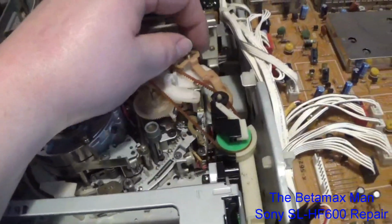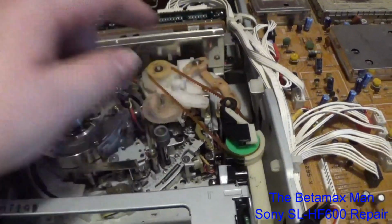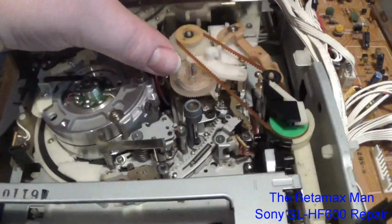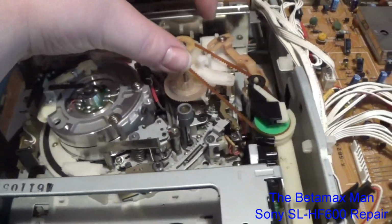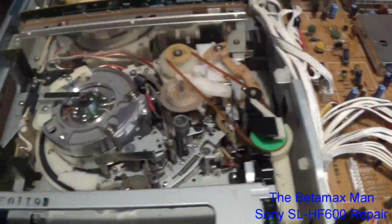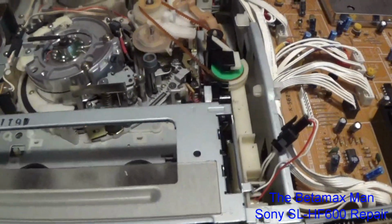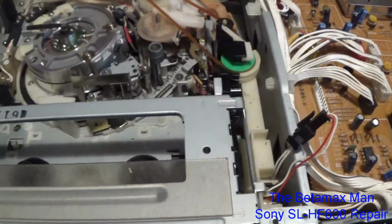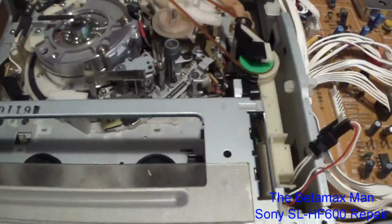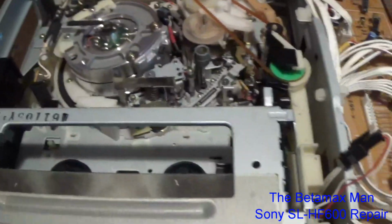And like I said, the B22s, they eliminated the tensioner and they eliminated this little tiny plastic cover, and they went to a big white plastic cover that covers quite a bit and keeps the belt from flying off. That's really the difference in the design. The last B2 chassis had just a little bit of a different mechanism as far as the cassette housing and the belt tensioner.